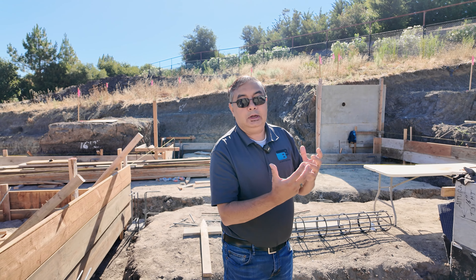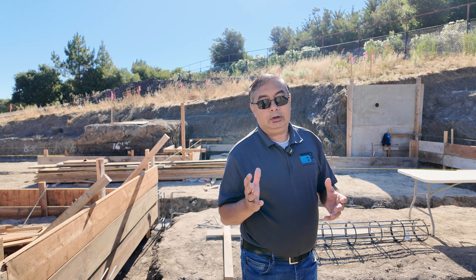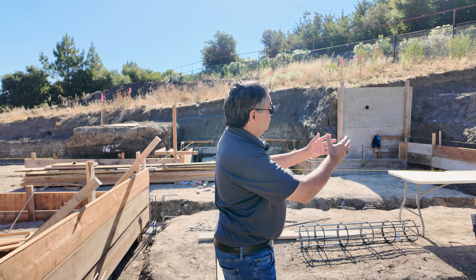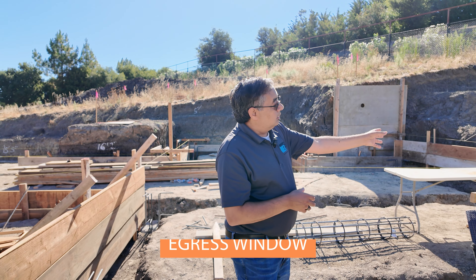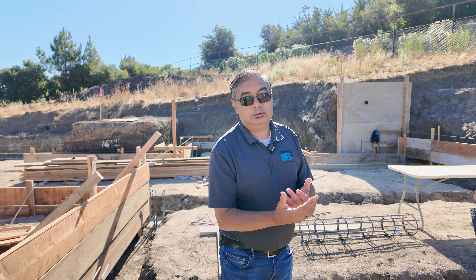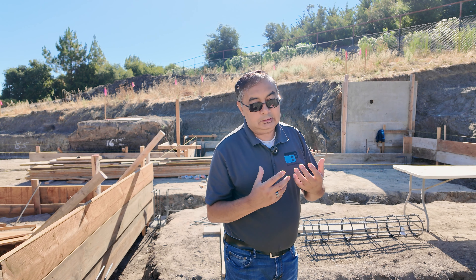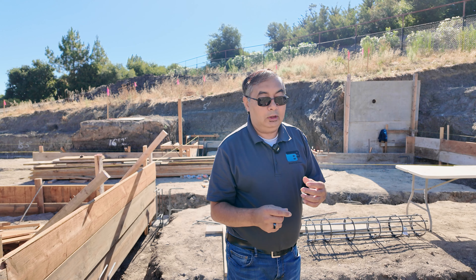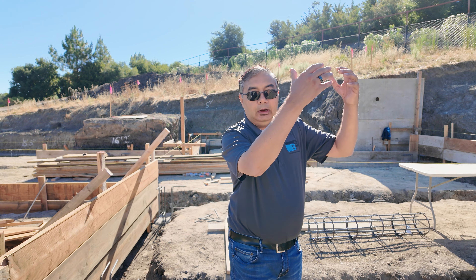When you have a subfloor partial basement like this, it's basically a concrete bunker — you don't want the soil collapsing into the basement. A certain structural integrity consideration is given to the basement, a different type of design than the area upstairs. Upstairs we also have challenges: bedrooms require egress windows so that in case of fire you can jump out. But those egress windows cannot lead into a mountain sitting outside. So we have steel wells outside the windows with a protected area and a ladder — these are called light wells.